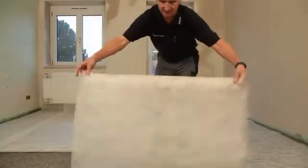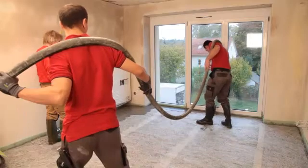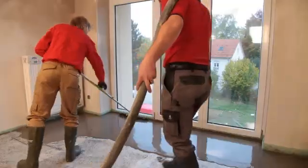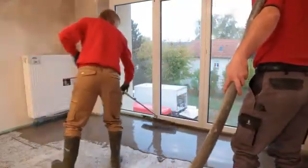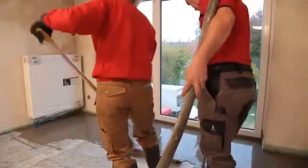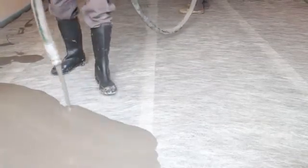Lay the fleece loosely over the whole surface with at least 2 cm overlap between lengths. Mix USIN NC195 with clear cold water and apply over the fleece with a smoothing trowel. Do not aerate the screed. Crack control joints need to be created in the screed within door frames; they can be repaired with USIN NC182 before installing the floor covering or fine leveling.